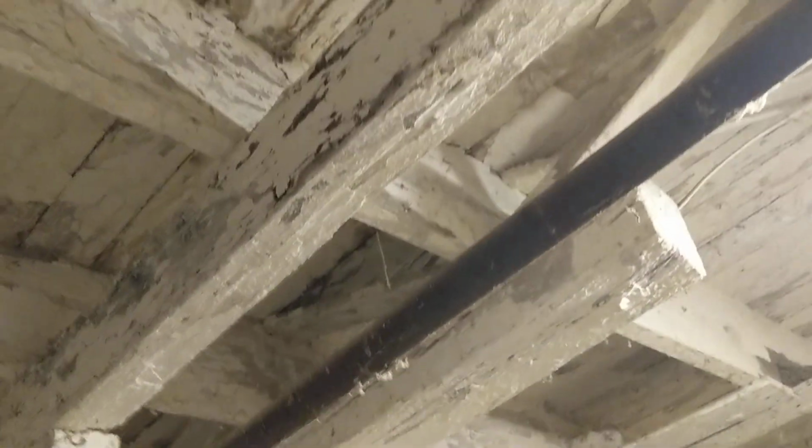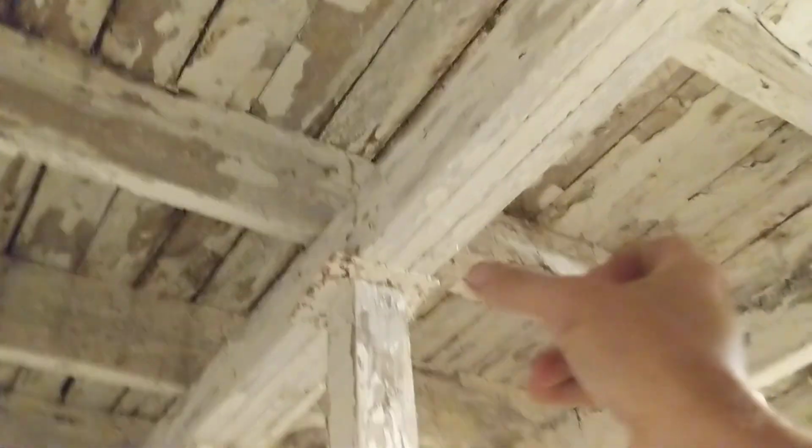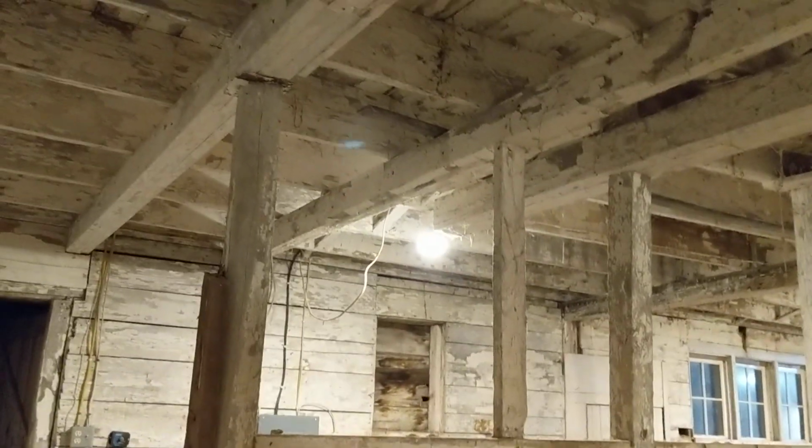Then I got two beams that are only like 2 feet apart. They're kind of hobbled together out of 2x6. This one's 3, that's only 2. I can't move them, so that tells me that they are taking load. And when I look at the structural support of this one in particular, it is wide enough to take a 6x6 beam, but it's only supported by a 4x4. So I'm thinking I might shore those up, hack these out, and replace them with 6x6. It's pretty easy to do.